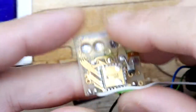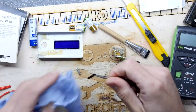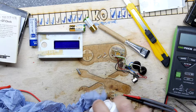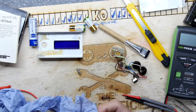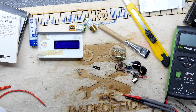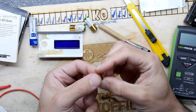I'm going to solder that back on and see if it's made a difference. Let's clean the gunk off this because it's a bit gooey. It's really weird — the actual legs on that crystal are crazy thin, not like normal component legs. So I'm going to be a bit cautious with that. I'm not sure if it's compatible with any modern crystals we can get, so I don't really want to abuse it. Just wiping that off — seems quite clean.